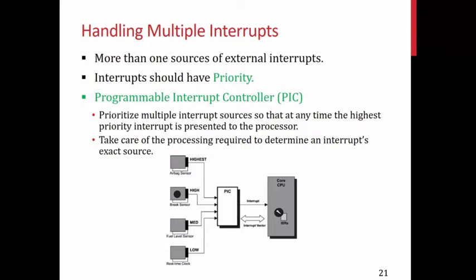Processing time is this period here, and the latency is this one, right? No, I think don't refer to the slide. This slide is not so well done. The latency part is more like when I press the button. After I press the button, there's some time before the code for the button starts to execute. Then this is the code. So this code here is the interrupt code? Yes, the ISR. Oh, okay. Thank you.